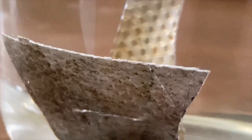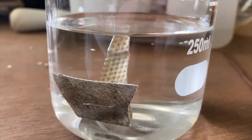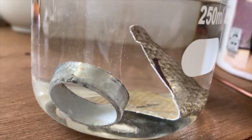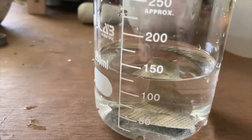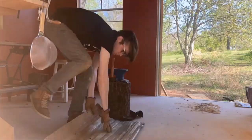First, I need to identify what type of metal my scrap is. To check for zinc or zinc galvanization, I submerged a piece of the metal in vinegar — nothing happened. For comparison, I dropped in a galvanized steel pipe, and as you can see, it bubbles profusely as it generates hydrogen gas. To confirm, I prepared another solution, this time of dilute sodium hydroxide, and dropped in the scrap. It immediately began to bubble, confirming that it is, in fact, aluminum metal.